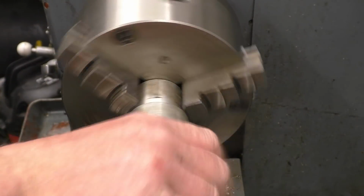So we'll see if we can find a bit of aluminium, turn the flange, drill it and tap it, and put a helicoil in. I'll probably put a little shoulder on so it fits inside that tube and then weld it on.